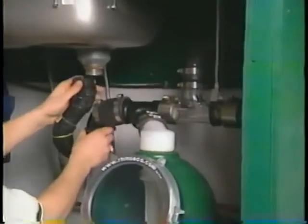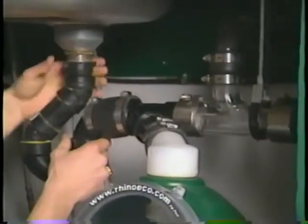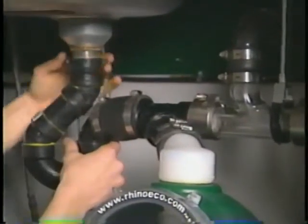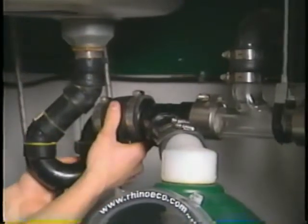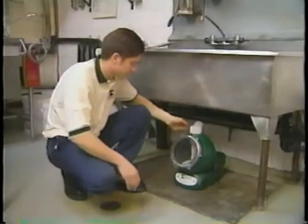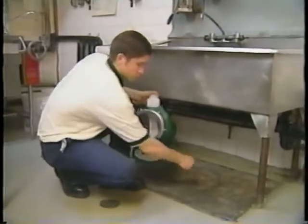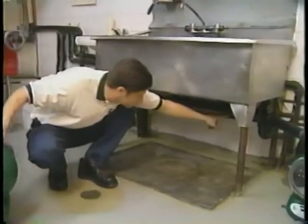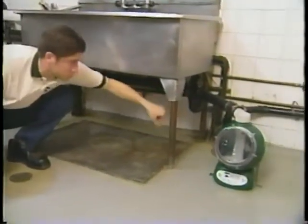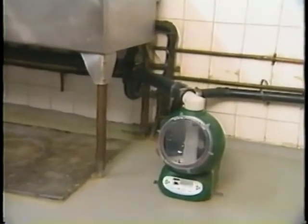When installing a single gravity unit, connect to the sink outlet immediately downstream from the P-trap with an appropriate length of piping and direct this piping toward the top inlet of the gravity unit. It is not necessary to locate the Rhino directly below the sink. If the sink outlet is too low to accommodate the unit or if space requirements are too tight, locate the Rhino to the side of the P-trap using whatever length of piping is required.